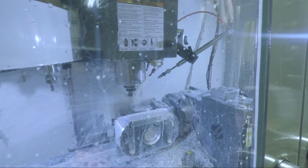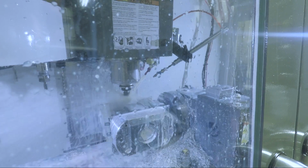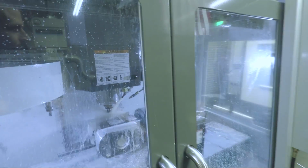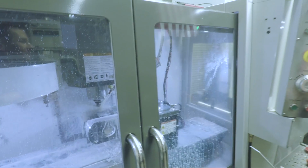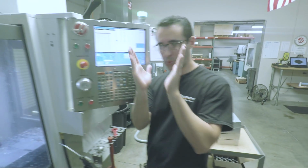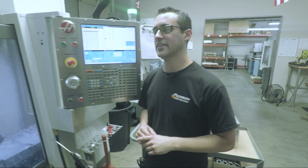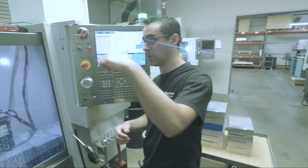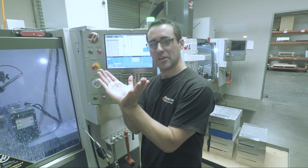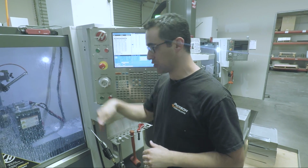What this is doing, I want to say, is an adaptive with a tapered helical entry. Yep. The next one is going to be a 1/8 inch NPT tap. So you're opening it up instead of having to use a tapered reamer there. Exactly. And at the bottom, it's putting a flat bottom because we're going to come in with a longer drill that can't meet up. It's off center, so we need a flat bottom for that drill to drill straight.